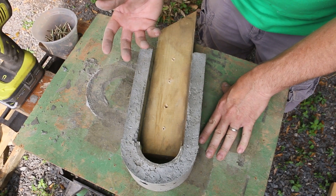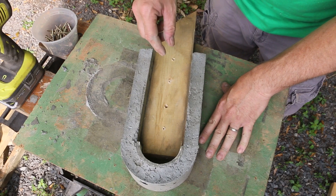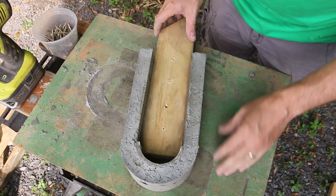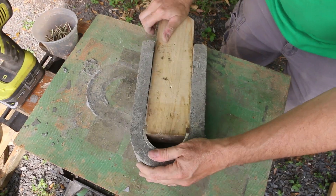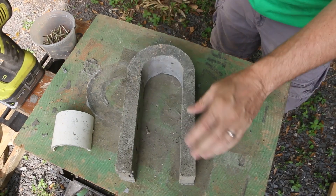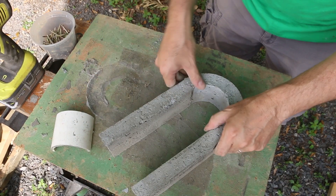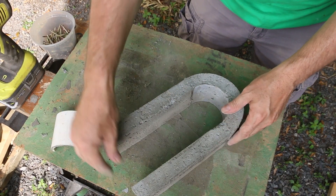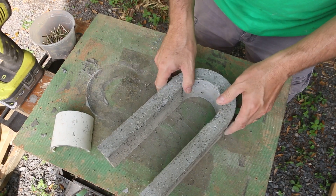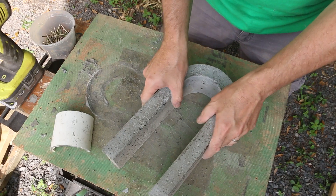I'm being very careful here and I think it's going to be okay. I was working with the materials that I had. The section of pipe on the outside kind of set the dimension for this whole stove. I think I could have helped myself out a lot by making forms from scratch — that would have allowed me to actually choose the dimensions of the stove instead of letting them be defined for me. Alright, safely out of the form, but honestly this isn't the part I was worried about. It's the riser sections I'm worried about, and those are next.